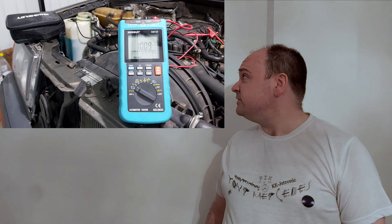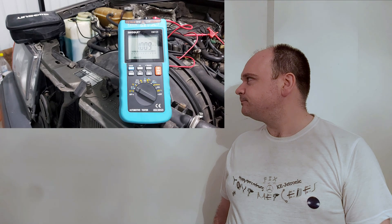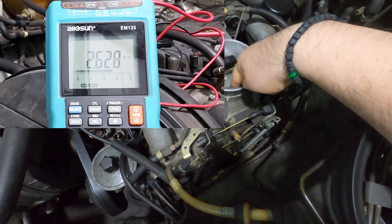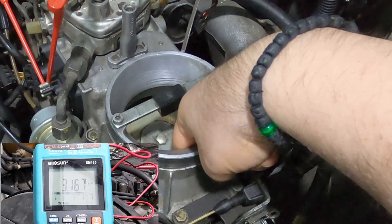I'm going to put the video of my own potentiometer check here. As you can see, the starting value is shown, and now as I start deflecting the sensor plate you're going to see that value increasing, increasing, increasing — and in the last third it's not decreasing, it keeps on increasing. That's something that got me confused.